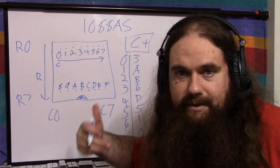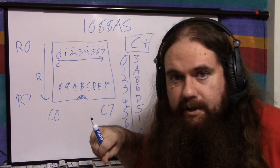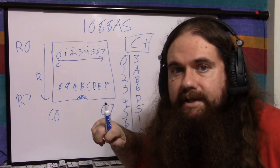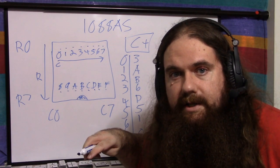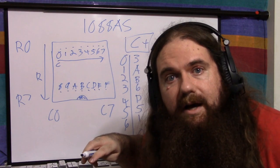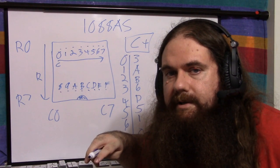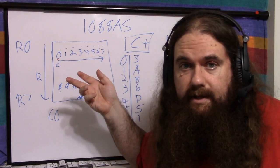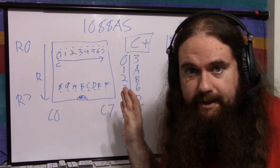Why do we put up with this? You're looking at this going, why do I want to deal with this? Because first of all, I got 8 of them with controller boards ready to daisy chain for $15. The other reason is, even TI ain't perfect. You look at TI as the pinnacle of American engineering, and then you realize they used VCC and VSS in the same datasheet. And then they had an inverting and non-inverting chip and labeled both as inverting. Professional AAA companies might make better stuff, but they still ain't perfect. And like I said, $15. It's not complicated, it's not difficult, it's just annoying. So just write it down, print it out, and refer to it, and you'll be good.